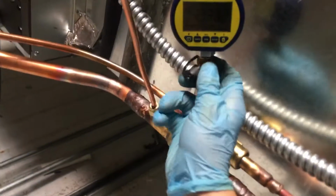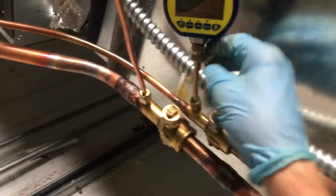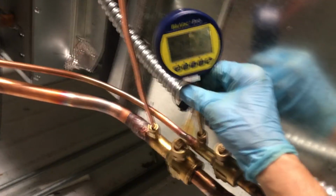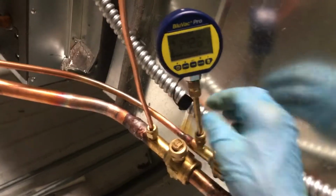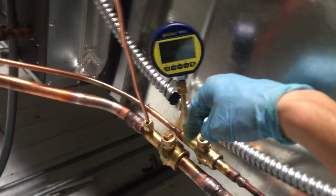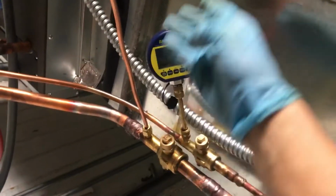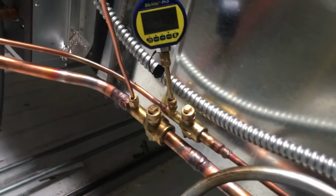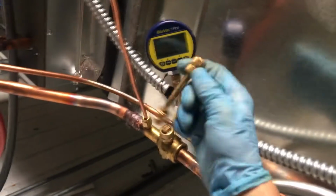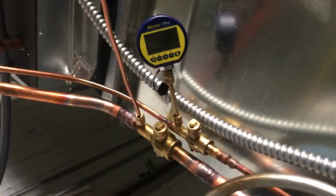Remember in the last video, it was around 2,000, 3,000, and it wasn't moving from there. And just by chance, I decided to tweak on turning the seals a little bit and actually just touching them, and it dived all the way down to 700 microns. It started pulling 700, 800, but then it went back up when moving it around. So, has my problem been with one of the seals on this?